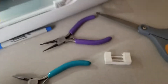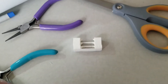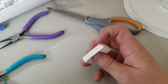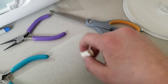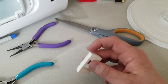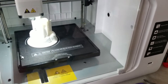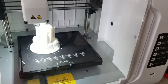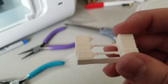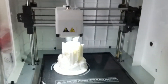An update on the temperature tower — 220°C turned out to be the best unfortunately. What happened was it broke off and wasn't able to keep the connection; I'm not sure if that was due to the bed. I changed it so the bed is at 60 degrees Celsius, and it's printing now at 220 because that's what I saw was the best — it didn't have as much drooping. So right now I'm printing the Zelda bust.